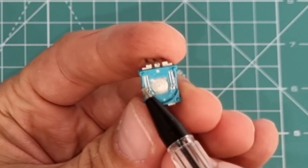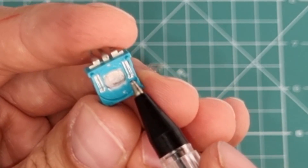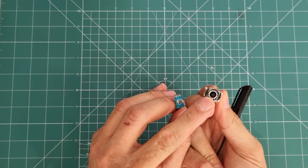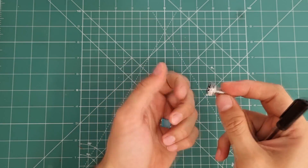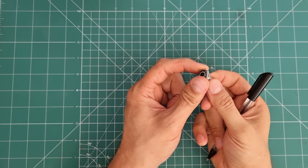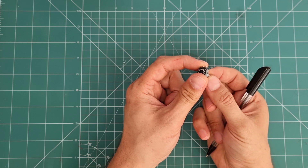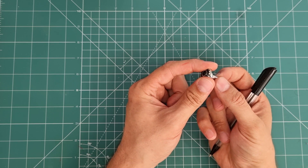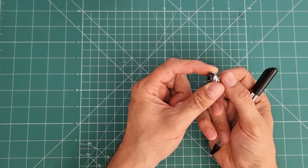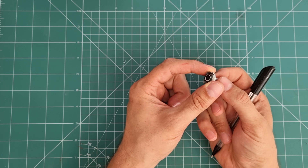These two pins are the signal electrodes, and small electrode contacts connect the common pin to the disk. When someone turns the handle, the common pin connects to the signal pins in the order already mentioned. There are different types of rotary encoders on the market, but the principles and signal waveforms are the same — the difference is just in timing and signal shifting. I hope you enjoyed watching this video. Please subscribe to my channel for more videos — see you later.